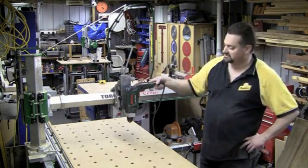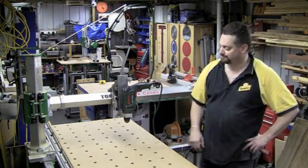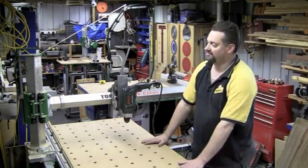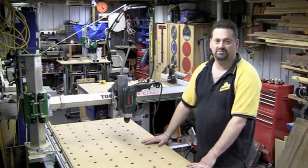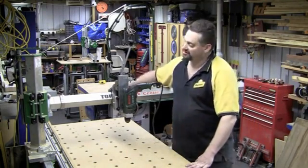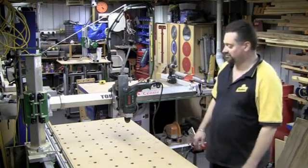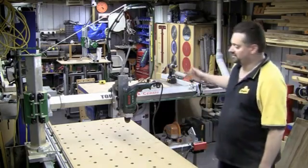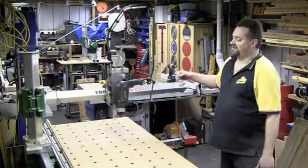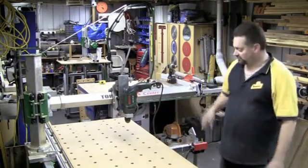With the aid of a drill that I've attached using the drill bit attachment — the first three degrees of freedom, which are pretty common sense, are the X, Y and Z axes. On this machine, I can lock each of the axes individually and separate to each other. If I unlock the X axis, the machine can traverse back and forth carrying the tool with it. That axis can be locked with a brake there.